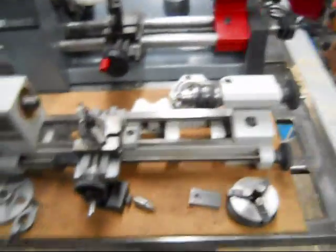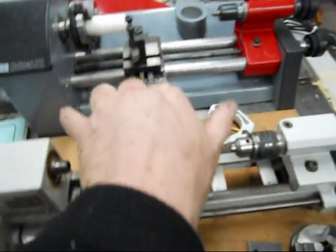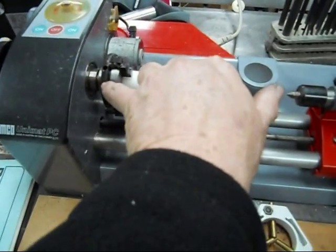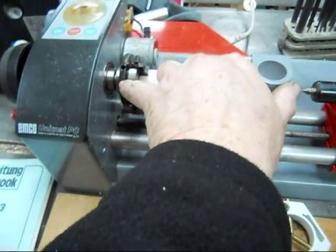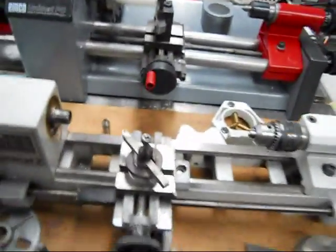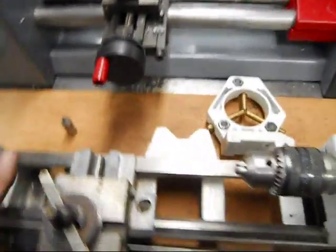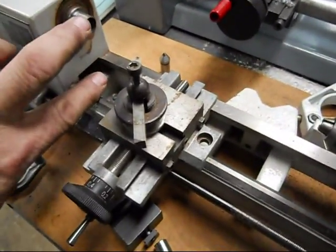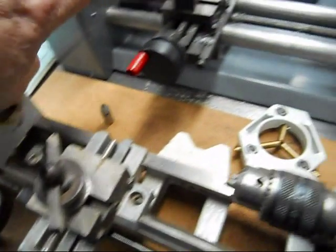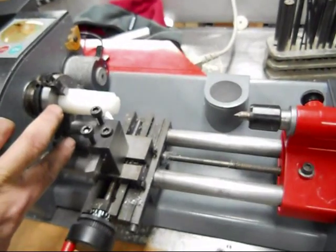Let's talk about differences. There's a pretty big difference in the admitted length between the two lathes. The Unimat 3 is probably a good inch less in length available than there is on the PC. Also, the turning diameter is quite a bit smaller — it's probably about a three-inch lathe, whereas the PC is probably a four, maybe close to five-inch lathe.